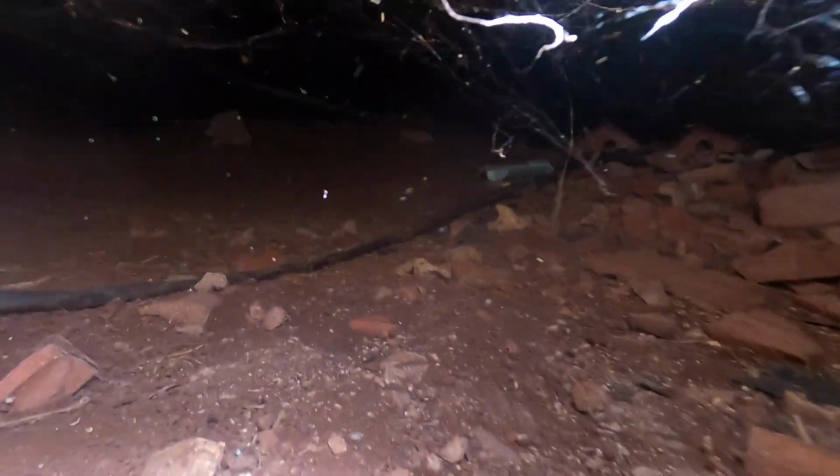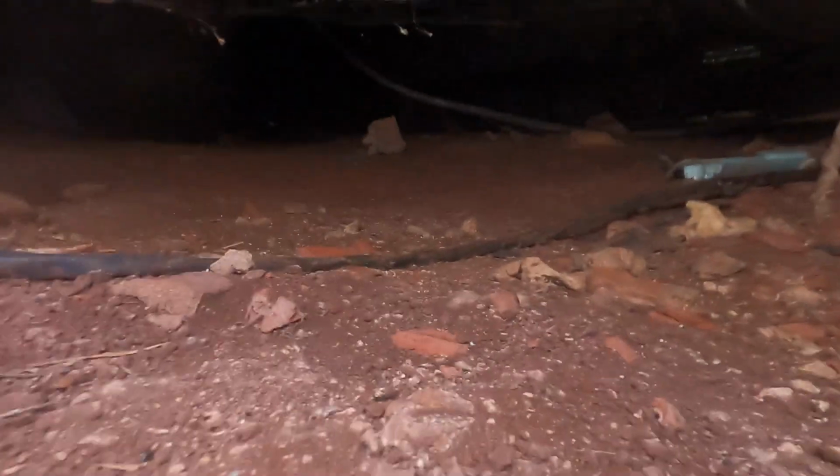I also looked down in the crawl space, and you can see no one has looked in here for 15 years. But yeah, with all that water moving down from the front, this crawl space is really wet. There's no water standing at this time, but you can see evidence of the water where it's pooling, and this needs to be corrected as well. However, I think that solving the negative grade will fix this problem.